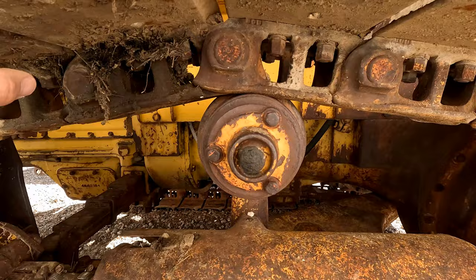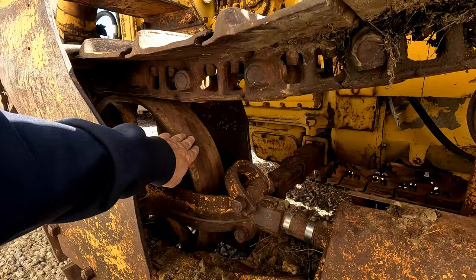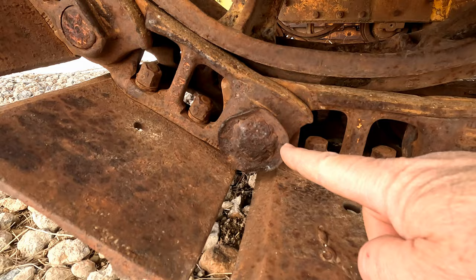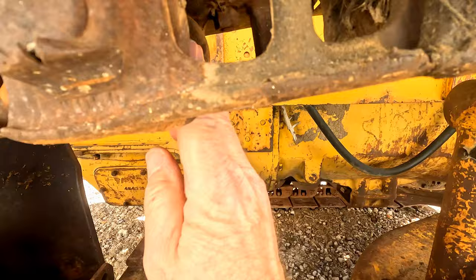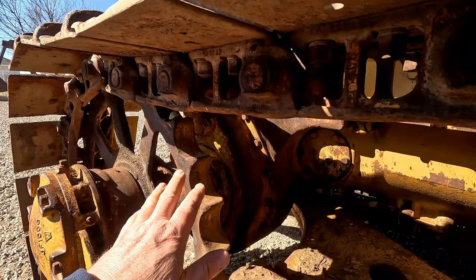Not great tracks on this machine. Now the grousers aren't terrible — I think they've been rebuilt at one point in time, you can kind of see the welding on here. A lot of undercarriage wear on this one. Those sprockets — they might be the worst ones I've seen. Just noticed a very interesting — I think this is somebody's attempt at a master pin, welding the cap on there to hold it in. Not good. The rollers on top aren't bad — they're serviceable. I'm guessing these pins have not been turned. That's kind of surprising considering the amount of wear on these chains. The other side, virtually the same — chains, sprockets, pins have not been turned.